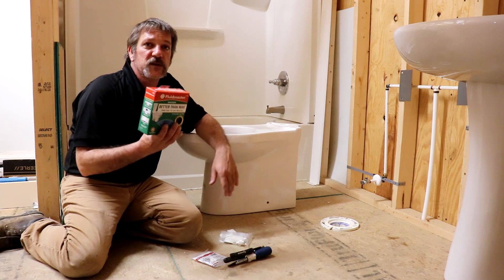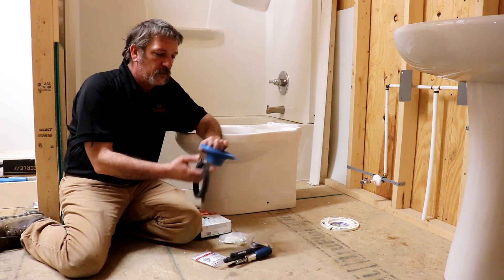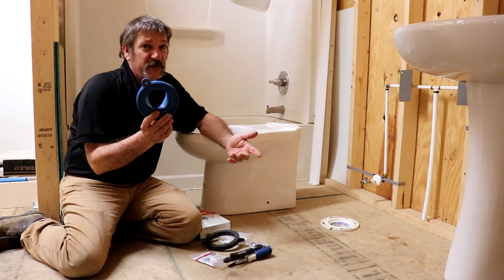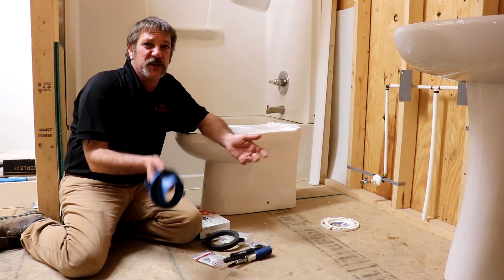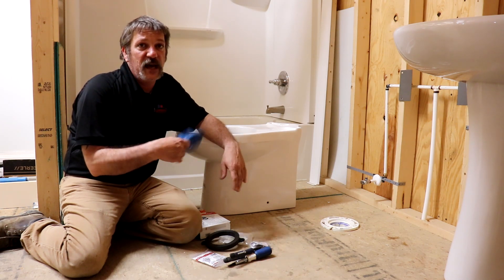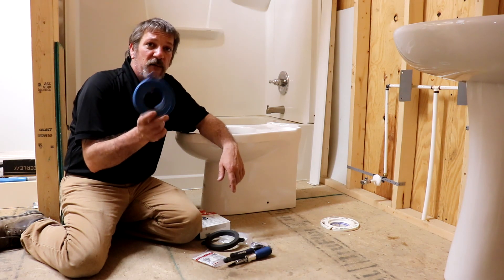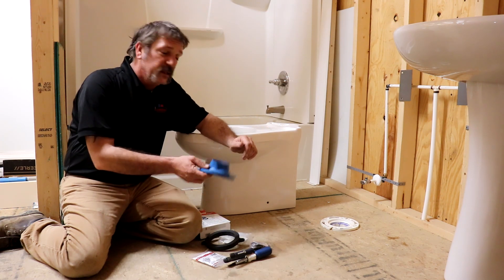Out here in the training center, I don't use conventional wax rings. I've got these rubber ones that you can reuse over and over again — these things are supposed to last forever. The cost on these is about five times more than your regular wax rings. If you're just going to install the toilet and leave it, never pull it again, wax rings are perfectly fine. But out here we set and pull these things over and over again, and that wax would just be everywhere. If you're doing a remodel and you're going to be pulling the toilet in and out, I recommend going with these because you can reuse them and they don't make a mess.